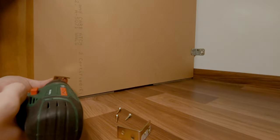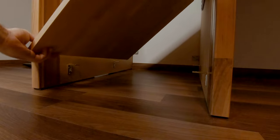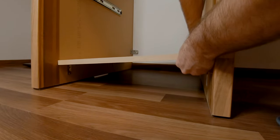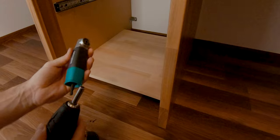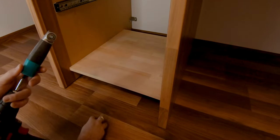This would serve both as a storage space and a support piece for the side panels. In order to fix this bottom shelf I used some more corner brackets. As the space for fixing the screws was very limited, I had to use an angle adapter for my drill.